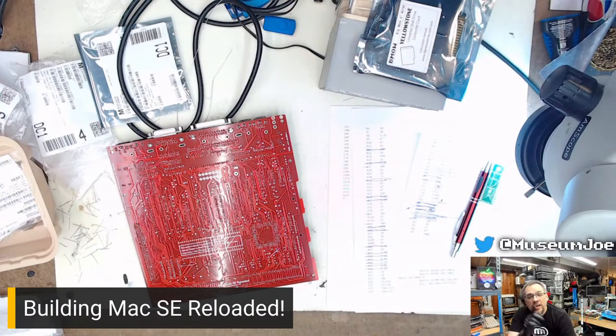Maybe you can make the JCM modular. That was kind of my idea, because if you go back and look at my video series on that, that was one of the original goals. You'll see that the idea was you could, in theory, build it. It would be a final board, but it was designed and built up in a way that you could populate a CPU into it and connect a couple little extra external circuits, and it'll run. It won't have all the extra stuff on it, but it could run, and you could see what it was doing. Then you could add the serial port and the ROM to figure out how the ROM code worked and stuff like that. That was kind of the idea.